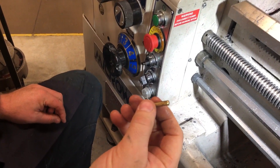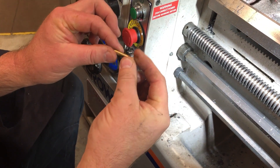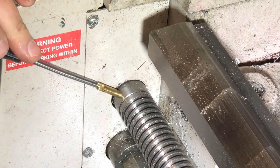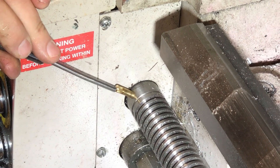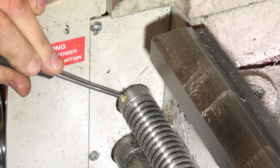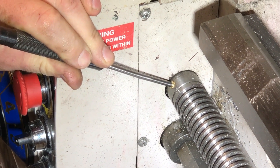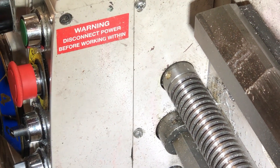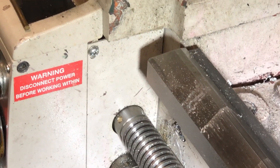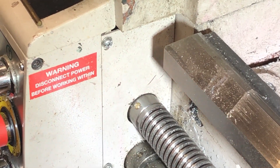The pin that comes with this — the manufacturer sends a couple of replacement pins with each lathe — and they have a knurled segment on there, and that's the hole that's in place. So I'm going to drive it through smooth end first, and the knurled end is the finish. I want to bury the knurl because the knurl is what holds the pin from spitting out. Some pins are tapered, but these are parallel — it's the knurl section that holds it in. I'm going to tap it down so it's flat, flush. I'm happy with that — roll it 180.